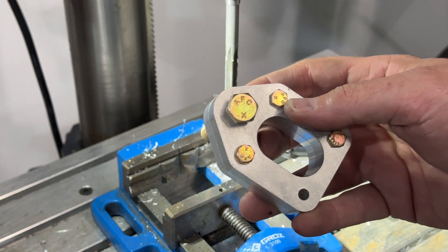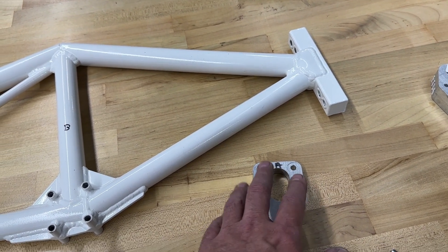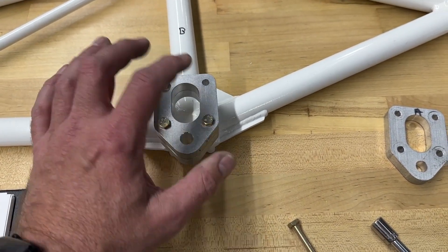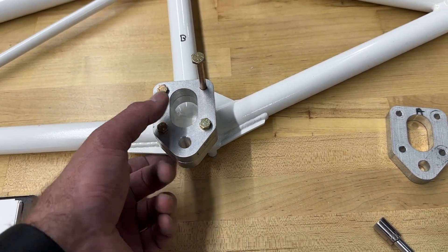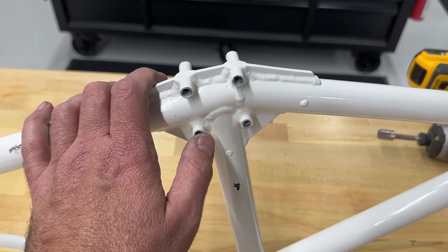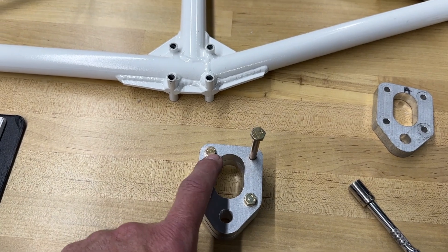So if you want tight-tolerance fits on your AN7s, go for 11 millimeters. Now on my truss, I happen to know that this hole and this hole are exactly the same spacing as they are on the machined component, so I can safely take this bolt out, open that up to 6.3 millimeters, drop this down and bolt it with these two bolts, and cinch it down with the nut to secure it. Then I can flip it over and run my drill bit on the lower tubes through - doing the 6.3 millimeter, and I can always go to quarter if I need. Let's get started opening up this hole.